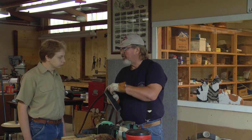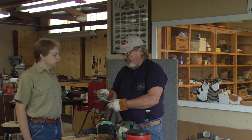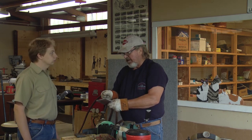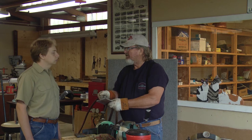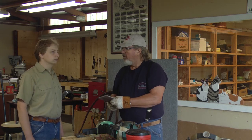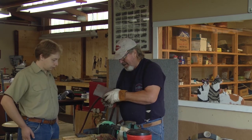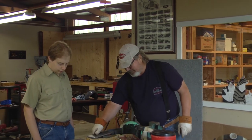See how the lines are nice and straight? That's basically how it should look — the edge is not burnt way over. You'll know the speed as soon as you start cutting: if you keep losing your line, you're going too fast; if it's getting a lot of melt over, you're going too slow. It's pretty self-explanatory once you do it.